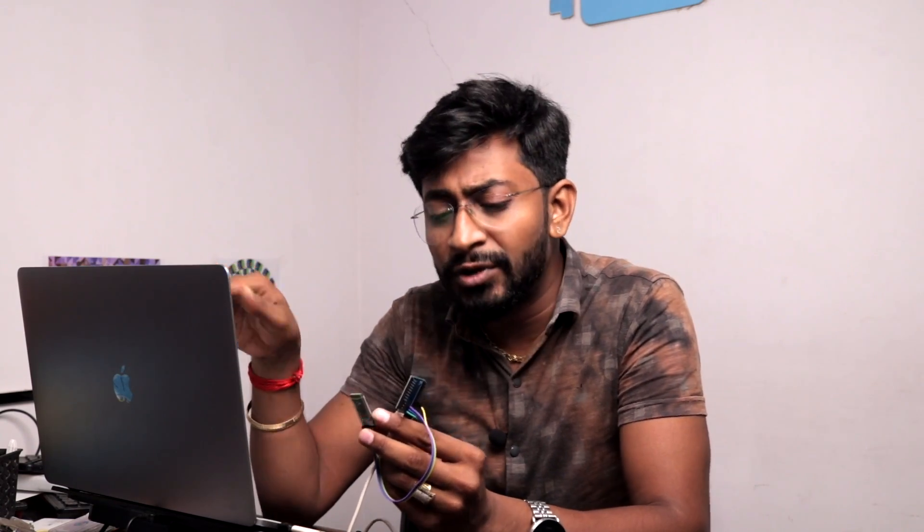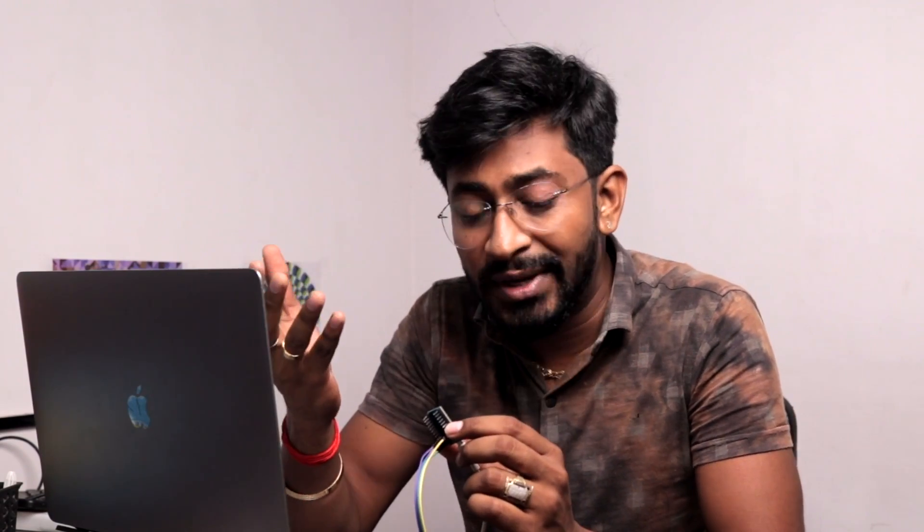It's not as straightforward compared to other Arduino boards, because this board is based on the ATmega32U4 chip which has built-in USB communication. That built-in USB communication takes the default serial port, UART0. So if you connect the HC-05 module directly to the RX/TX pins of the Arduino board, it won't communicate on UART0 — it uses Serial1, the hardware UART1 of the ATmega chip. This is the same with the Arduino Leonardo board as well.